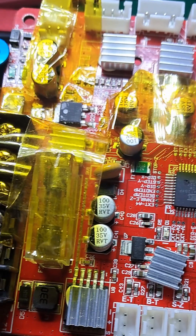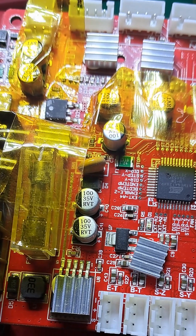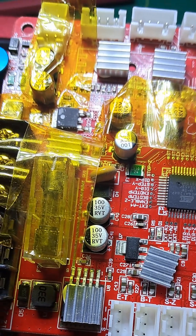Here in the middle, transistor Q3 must be replaced. This tape holds high temperature — I cannot melt it so easily — with a thermofan treating our patient. We start the printer and all the problem is solved.